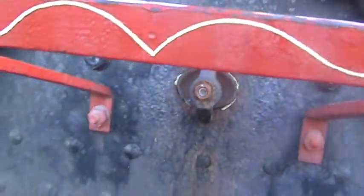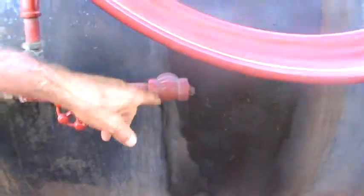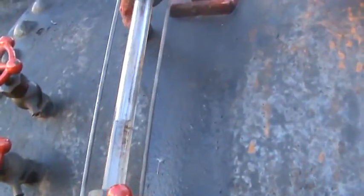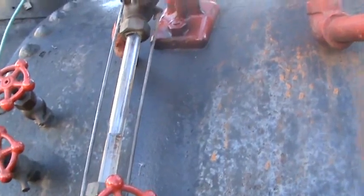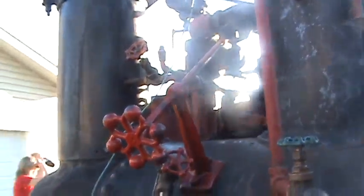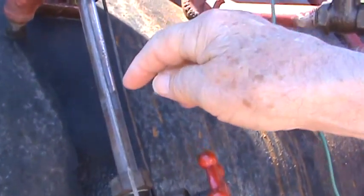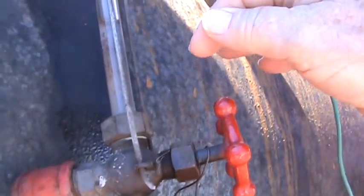And so this cylinder has water on the outside of it. It comes from that pump over here and into the boiler here. It replenishes it so you can see keeping it in the side glass right here. So that's the side glass — you want to keep her in the side glass. The water level has to stay in between these two valves. It goes down, it's getting dangerous, and you have to keep that water up there or the possibility of it blowing up is very real.